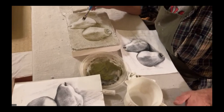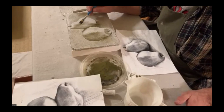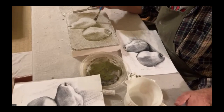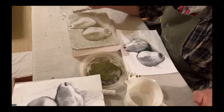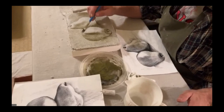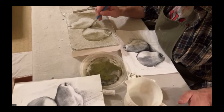And with a trowel, you want to make sure to wipe it completely dry and have it sitting on an edge somewhere so that it doesn't scratch. You want a nice clean blade that isn't damaged. There's nothing worse than having a burr show up in your plaster when you drag your finishing trowel, if it has damage on it or rust spots. If you allow it to rust by washing it and not drying it, the rust gets into the plaster and really makes life miserable. So it's just a little bit of housekeeping when it comes to fresco, but nothing outrageous.